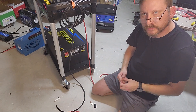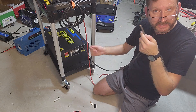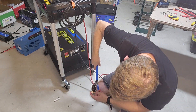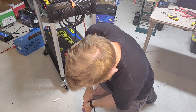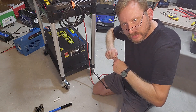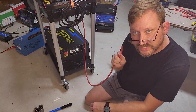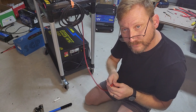Back on the ground, I'm ready to make my final power connections. I need to crimp my negative power wire — I'll leave it a little long so I can play around with it. Now you get to see how I crimp these connectors. Give it a good yank to make sure it's on good and tight, then put the little cover over it. Now for the positive, there are a couple of extra steps, including the pre-charge resistor, which eliminates the spark when you touch the terminals for the first time.